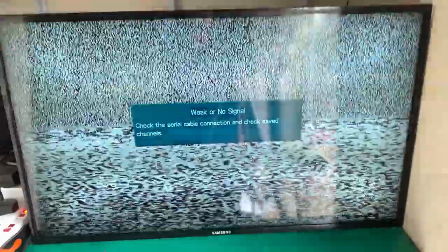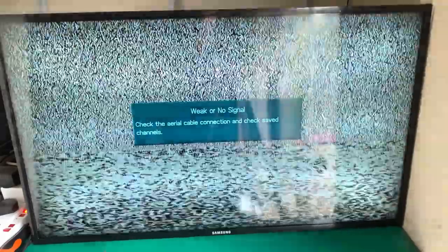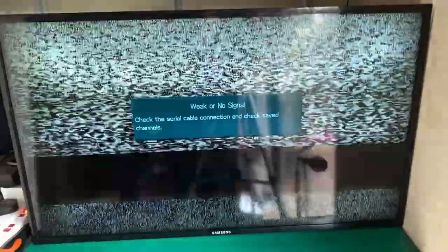Anyway, what we do know is with the main board connected, we are running with the pulse width modulation dimming at, well, not 20%, at 50%. In other words, with the pulse width modulation dimming from the board, we're running at 80 milliamp, where we actually set our current sensing resistor for 160 milliamp or 180 milliamp. So we're running at less than 50%, which is fine. These brand new LEDs should be fine with that.